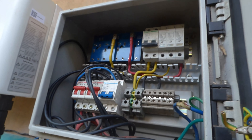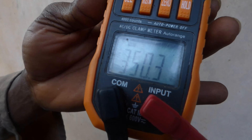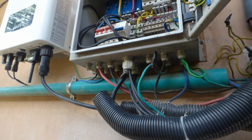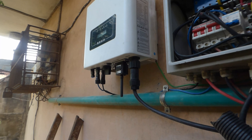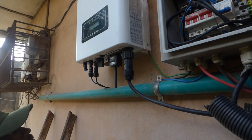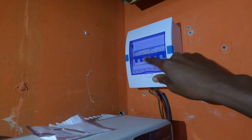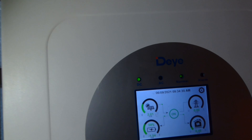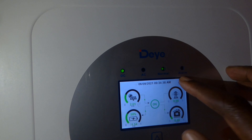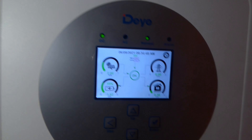We're reading 350.2 volts from our PV right now. We're going to energize the main inverter to start forming the grid for this one, and then we'll turn this PV inverter on. Our AC output breaker is on — we're going to label it so we know which is for the load and which is for the grid. Going into gen port, selecting micro inverter — turned that on and it just activated, so let's go outside and see what it did to our inverter.